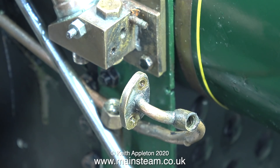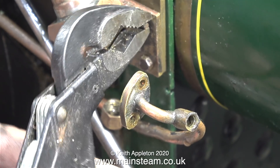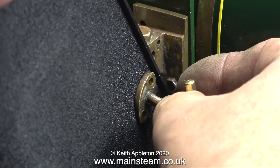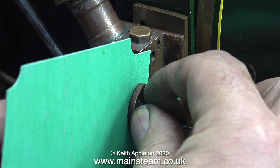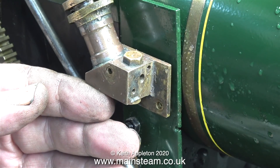I'm also temporarily removing this small drain cock because that also leaks very badly. Removing this top stud took quite a long time because I couldn't move the wrench very much — eventually it did part company with the block. What I'm doing here is using my ink pad to put some ink on the end of the flange, then I just press the gasket material onto the flange and made a new gasket. I refitted the flange complete with the new gasket to the block — I even used some gasket sealant on the gasket — and guess what? It still leaked. I didn't show the retest because it was identical to the first test.